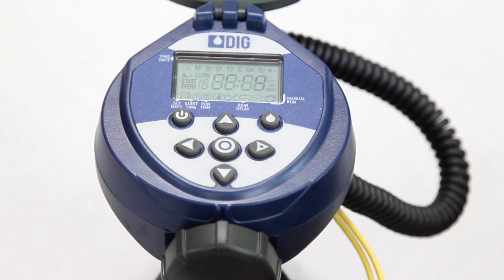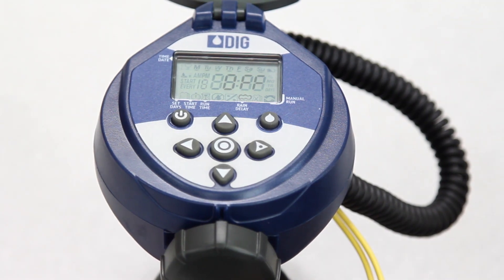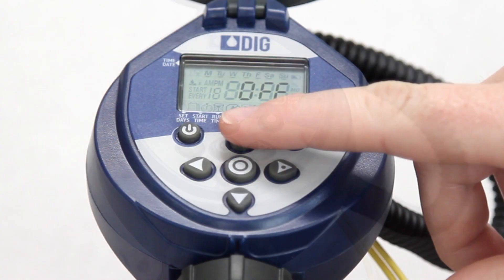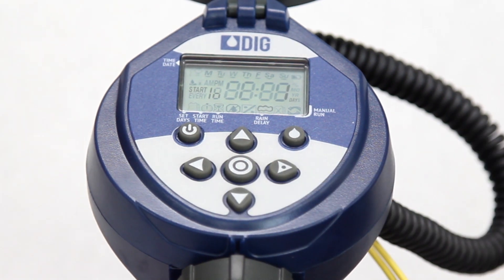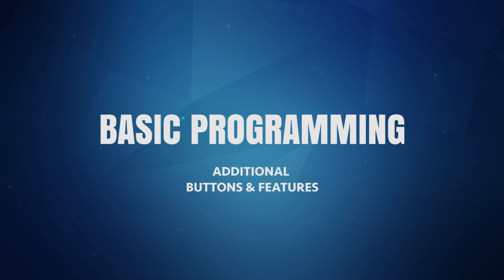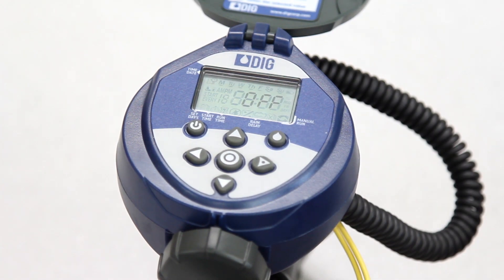To go into the cyclical days mode, press the right arrow button again and one day will appear on the right. To water once every four days, just push the up arrow button and change the flashing number to four. The timer will now water once every four days. The starting day of a cyclical program can be set in the rain delay mode. Simply push the target button until the rain delay icon appears at the bottom of the screen, then push the right arrow button to make the entry flash. Push the up arrow button and enter the number of days to wait until the program starts. With a one day rain delay, for example, the program will start the following day. The upper left-hand button is the program on/off button. The only function of this button is to activate or deactivate the automatic operation of the program. Press it once to turn an active program off and the word off will appear. In this mode, the program is saved but no automatic watering will occur. To resume automatic programmed operation, press the button again and the current time will appear, which indicates that the timer is now set back into its automatic mode.